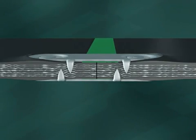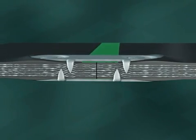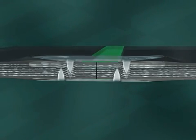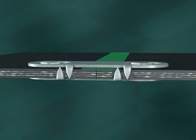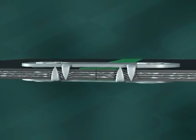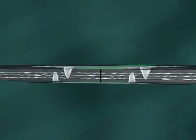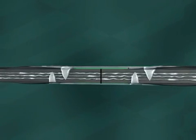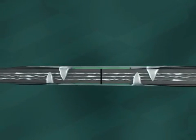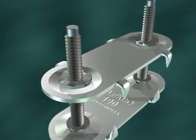The number 2 and 1.5 style teeth worked well on thicker belts. But on today's thinner synthetic carcass belts, the teeth can come in contact with the opposing plate, preventing proper compression. Since this problem doesn't happen with the newer style 190 and 140 fasteners, a stronger, longer-lasting splice is ensured. The newer style 190 and 140 fasteners are superior in a number of other ways too.